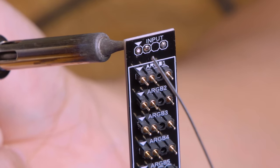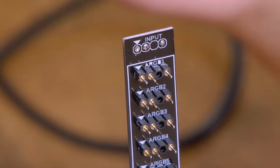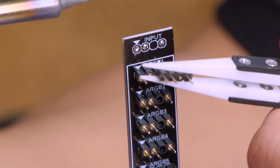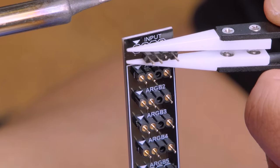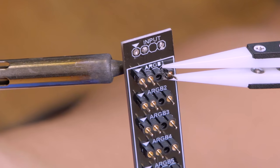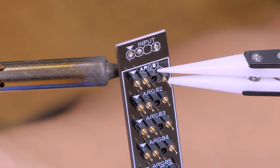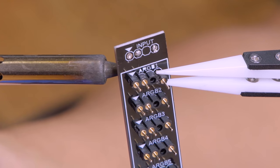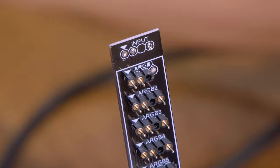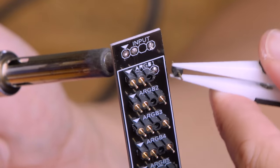On the one underneath that, I want to clip the plastic where the one is and see if you can do just one pin — that's all we need. Honestly, that's the easiest thing to do and there's no reason to replace all three. It is harder because of the fact that this iron is too short — you can't push it all the way through if one side is solid still. So I just trimmed the plastic right there, which completely wrecked the pin, but that's fine — we just need to get it out to recreate the situation we're in on the power board. Then Phil can reflow that hole and push one pin in, which is much easier. You can see how easy it was to pull out just one versus before. So now you're just going to heat the backside and push it through — that should theoretically be super easy and fast.